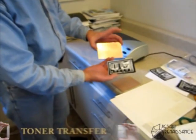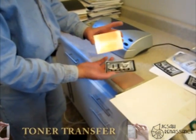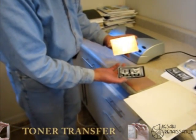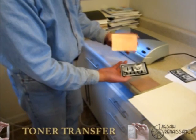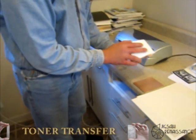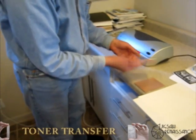What we're going to do here is we have the mirrored printout of the top layer. We're going to do this one first — this is more critical. It has a very tight accelerometer footprint there. So we're going to laminate this onto this board.